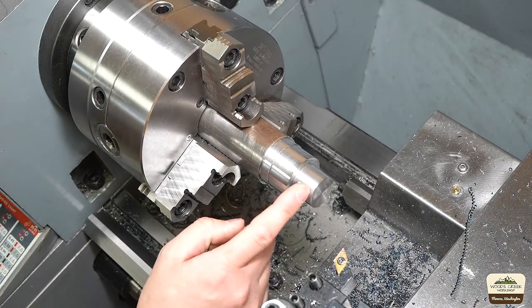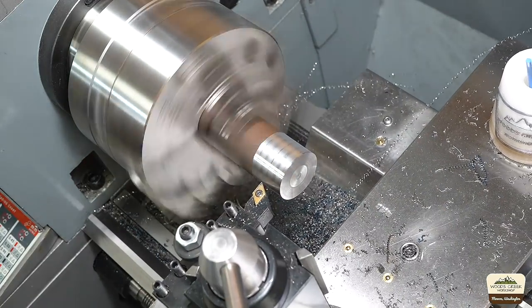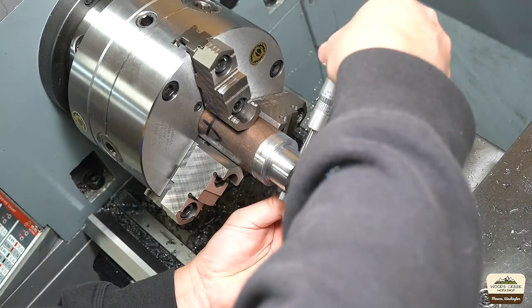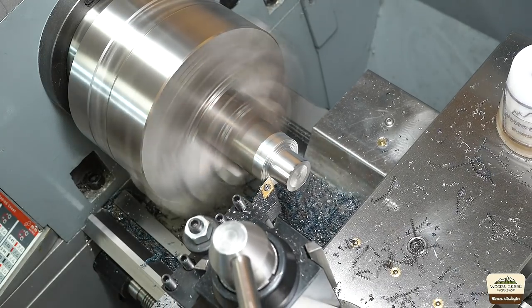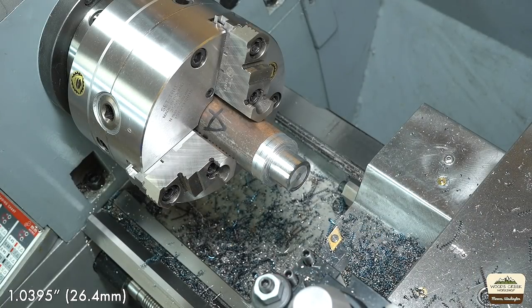It dawned on me — I can use that, because the shank's gonna be only three quarter of an inch, so we're just gonna flip it. Let's see where we are — 200 to go. So we'll set the dial, stop short of that. Now cooled off, we're at 1.0395 — just shy of 40 thousandths to come off. We'll take 35 off and sneak up to it.